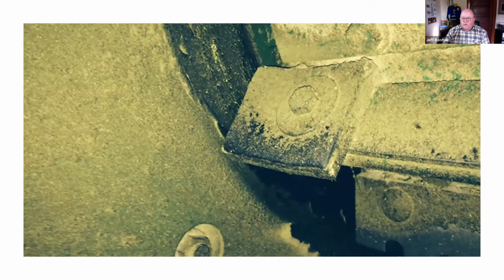Another simple cure is taking some baler belting on that rotor. You try to keep them all the same size to keep your beater in balance. It sweeps against the wall, and thus you don't seem to have that problem with wrapping. So there are little things with each combine you need to be aware of. We've got lots of data and lots of help for farmers with each and every different combine. The one combine we try to keep out of hemp as much as possible is the Claas, which just so happens to be the other two combines we run on our farm.